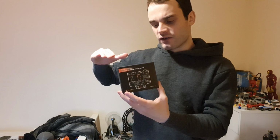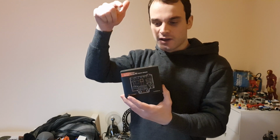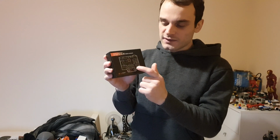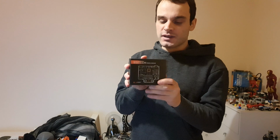So you'd have the Arduino running the lower level stuff, the Raspberry Pi running the higher level visual stuff, possibly still with the camera on it, so it can still feed vision back to the user via VNC, but you'd be using the Husky lens for object detections and people detections that it then reports back to the code in the Pi, and that would free up a lot of processing power on the Pi itself. So that's something else I could possibly put on this in future, but do keep an eye out for another project. DF Robot have just sent me a Husky lens, and I'll be definitely using that in another robotics project, so keep an eye out for that as well.